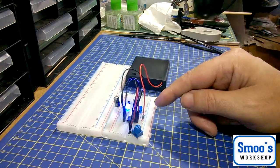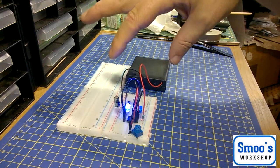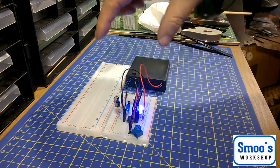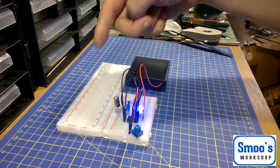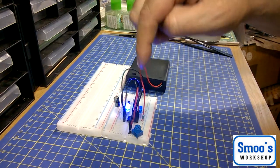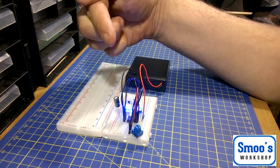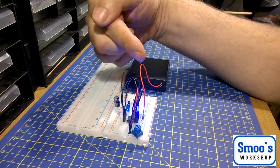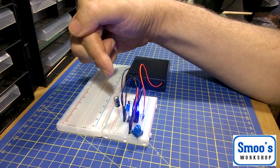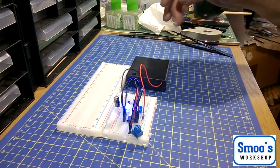And then I'm going to go on from that to using 3 555 chips, which is called cascading, where this one's a control chip that feeds onto 2 others, and I use 2 different transistors. Might all be gobbledygook. Basically this 555 chip sends out a pulse signal. When it goes high, one bulb goes on, and when it goes low, 0 volts, the other bulb goes on. So it's basically going high, low, high, low, high, low. Use that to time the other 2 chips, and I can get more effects with it.